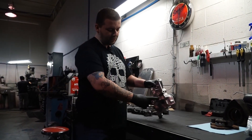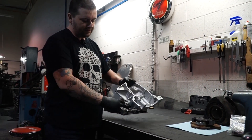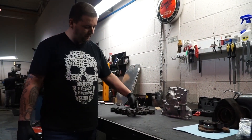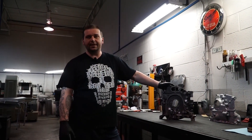But you have to plug up the out port on the front plate. So this is plugged, oil still comes through here, and it bypasses back down into the oil pan — still retaining the front direct out. That's it. Thanks for watching, till next time.